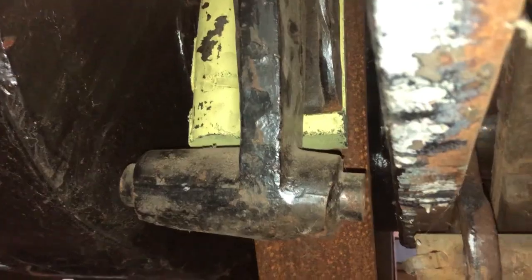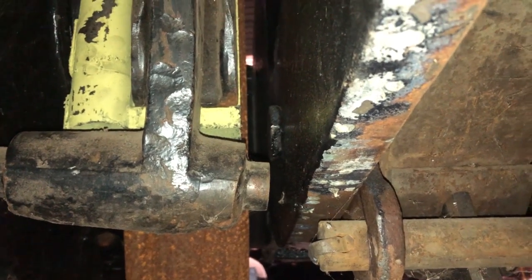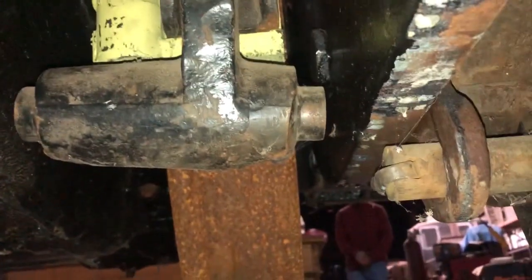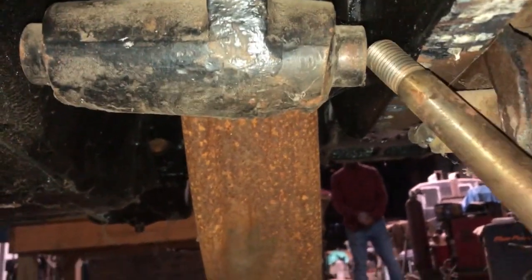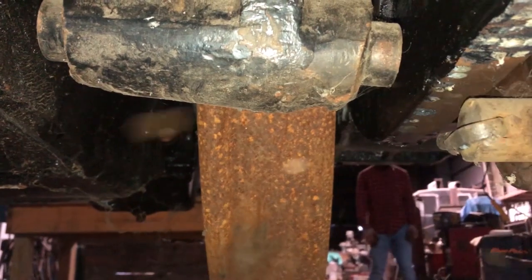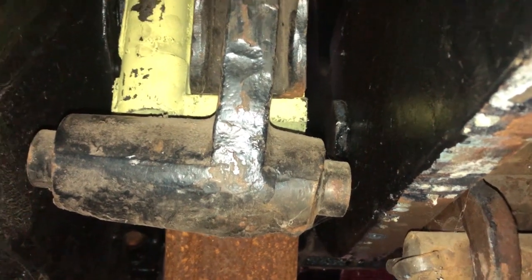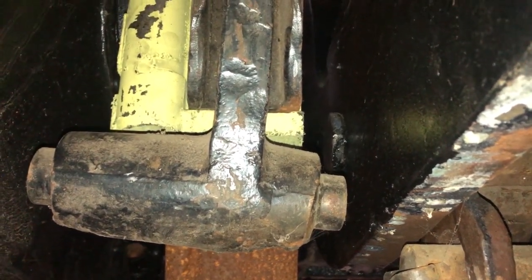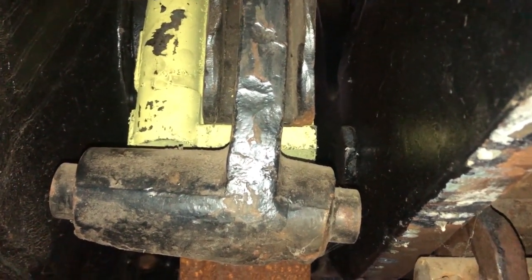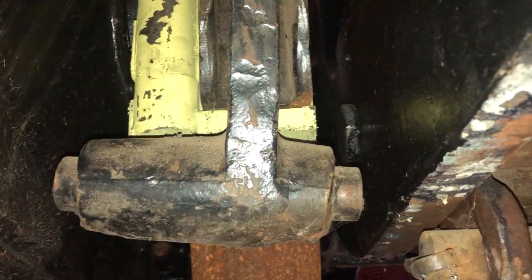One of the interesting challenges here is the bolt that we use to secure the brake straps to the inside hanger will not go into the hole for the brake rigging or the brake hanger because it's too high. If this truck were under a locomotive, there'd be enough weight to compress the springs. But since there isn't, we'll use the crane, take the pins out from up above, and lower this down to give us the room to get the brake strap bolt in.